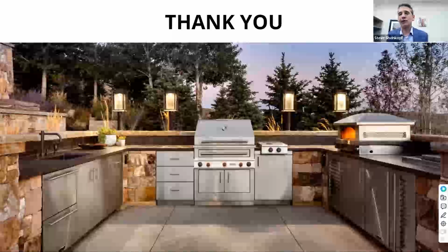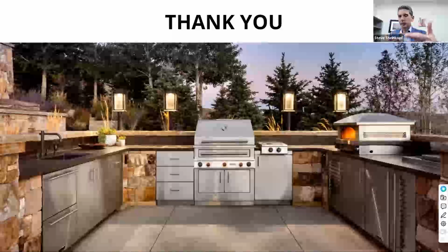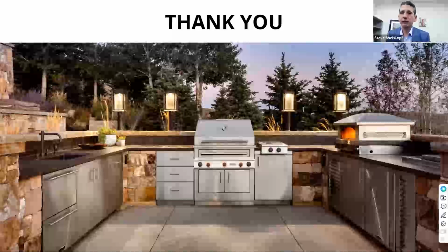I would just max out. The difference between a 1200 and 1500 CFM is a couple hundred dollars. I just max out the CFM. I mean, there's deeper hoods too, but 18 inches tall, 27 inches deep, 1500 CFM is really what I would go for on a grill, to get that stuff out of your house.